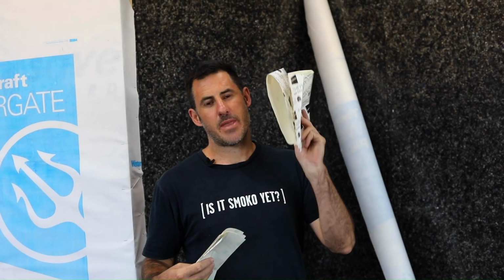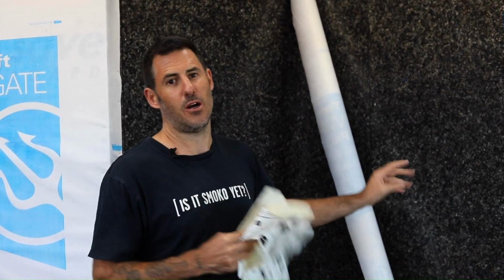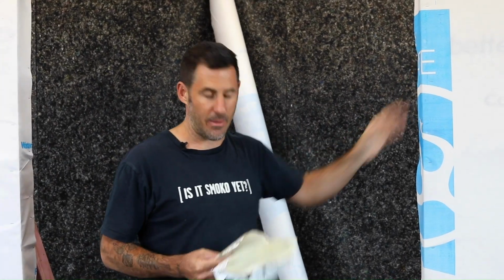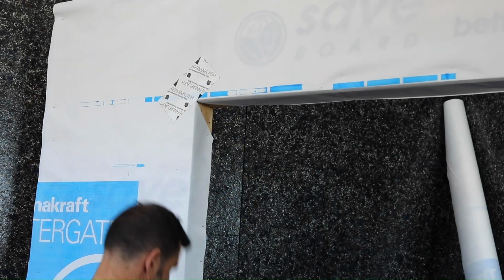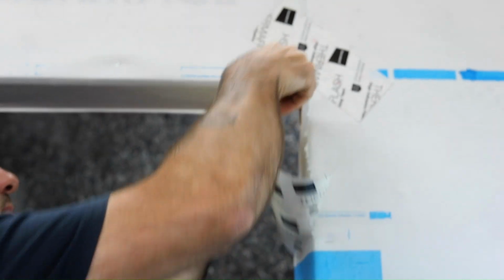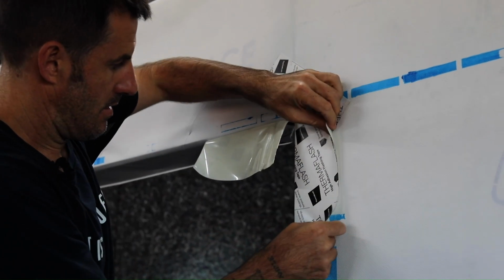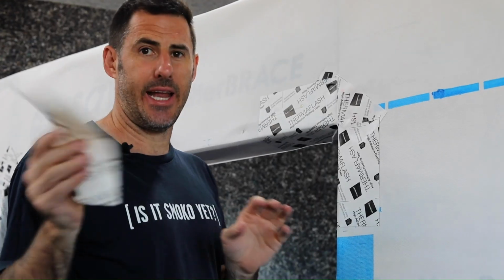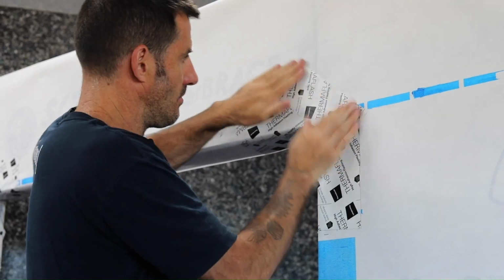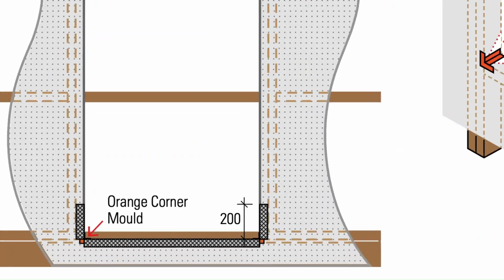So I got my butterfly strips and my 400mm pieces. Now we're ready to flash the opening as per standard. We would do top and bottom of all openings as you normally would for any synthetic wrap. Using 150mm wide minimum if you're on a 90mm frame. And our second butterfly strip on the tops. Look at that. Obviously you do the bottom of any sills, 200mm upstands.